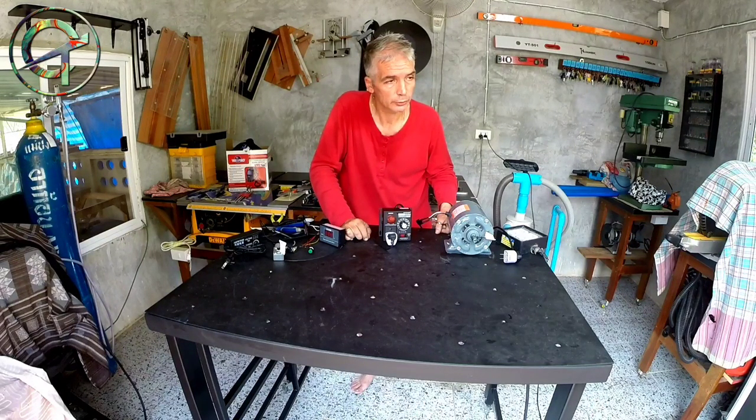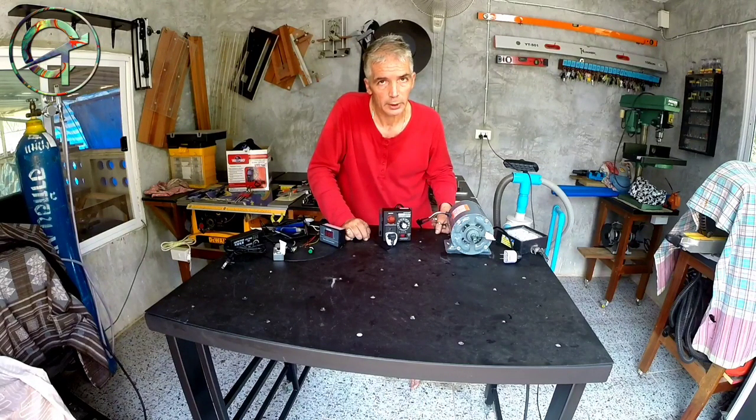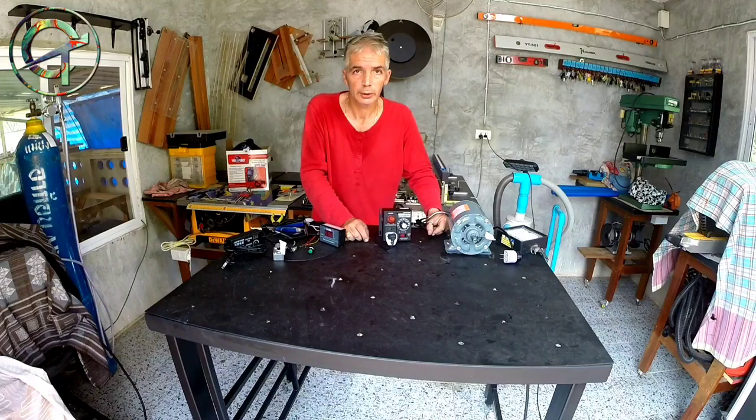My first attempt to build a welding rotary table was made with an AC motor simply because I had one already. I did not buy it. So, if you already have an AC motor, what's the proper way to make it work in a rotary table? We have two possible solutions. The first is a VFD frequency inverter, which practically is a speed controller that reduces only the speed without affecting the power, the motor torque. The only problem is that this device works only with AC motors that meet specific requirements. I won't go into details because we are trying to stay general.